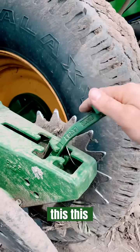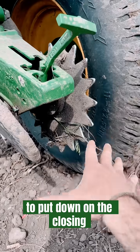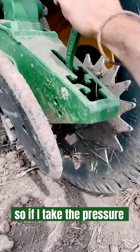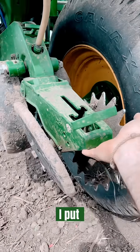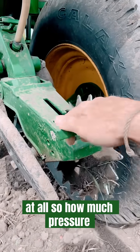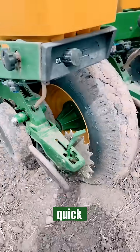You've also got little things like this — this sets the pressure on the closing wheel. If I take the pressure completely off, this thing will just kind of float. But if I put it on, I can't lift it at all. So it's about how much pressure you want to put down. In a nutshell, that's a quick glance.